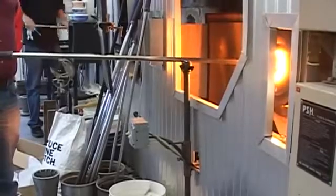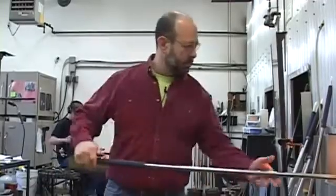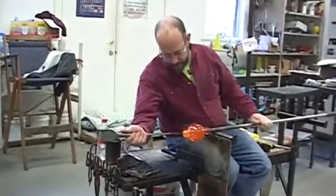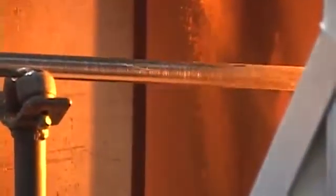I'm going to stretch the neck out a little bit, which will also thin it out. I'm going to accentuate the twist of the color in the neck, and I'll trim it to make it straight and even, and flare the lip right out. I'm just changing the distribution of heat from primarily in the body and the base — which is what it was on the pipe — to being in the neck and shoulder and lip area.